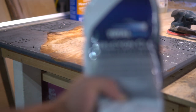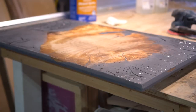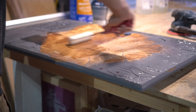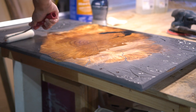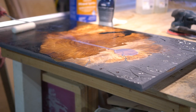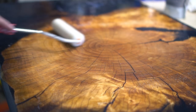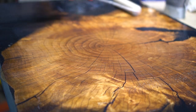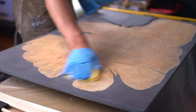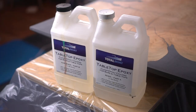We could use the slow cure epoxy we used previously, but I suggest using the Halcon clear epoxy because you can easily apply it to the back side, spread it on, and within an hour it's fully dried and ready for a second coat. I do two coats on the back side since it really doesn't need a full flood coat like the top. Once the back side is dry, I flip it over and go over it one last time with the tack cloth to ensure we get up all miscellaneous particles.